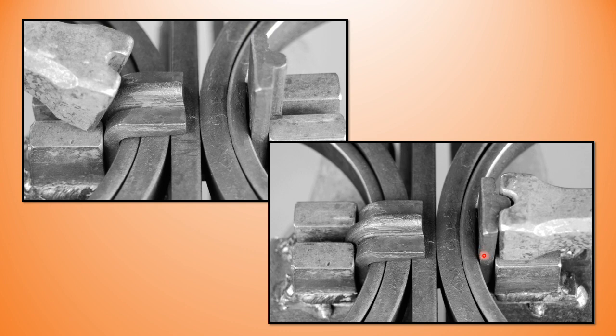The other thing that's important for me is at this stage when I'm fitting the collar to the Grille, this jig and therefore the Grille is closed up in the vise and is very stable. If you're working on your own, and I'm going to presume you are, this is a very powerful move. You're coming in here with a blow that's going to bend what is basically 5/16 of an inch thick bar, inch wide. And if this is not stable somehow, you're going to send the whole assembly to the floor. And I don't know what sort of language that's going to conjure up in my shop or your shop, but in my shop it's not going to be pretty.